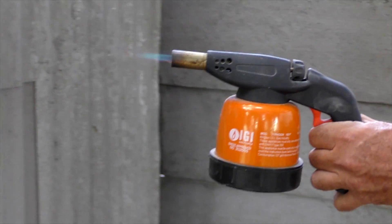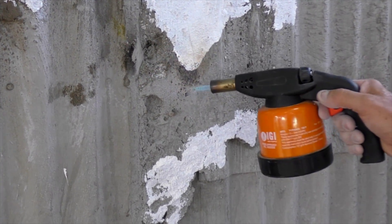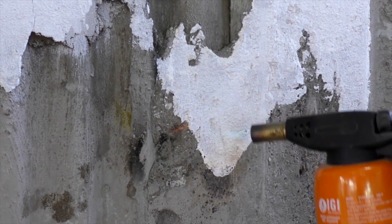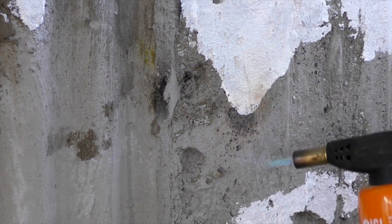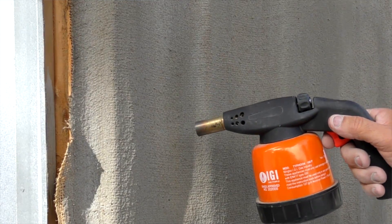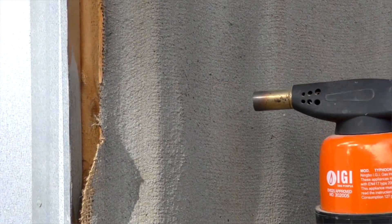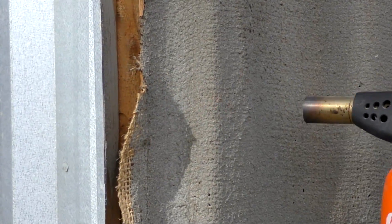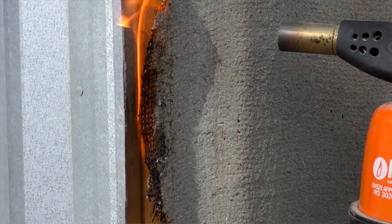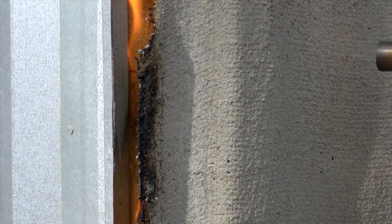Here we demonstrate the fire resistance of Thermocrete. This is a corrugated iron wall section plastered with Thermocrete, and as you can see the blowtorch has no effect on it. The polystyrene beads flare up and then go out. On the ThermaTrap fabric finish, the blowtorch has no effect on the flat finish, but fabric sticking out on the side immediately catches alight when the blowtorch comes close. However, it goes out the minute it reaches the ThermaTrap finish. We are extremely happy with this result.